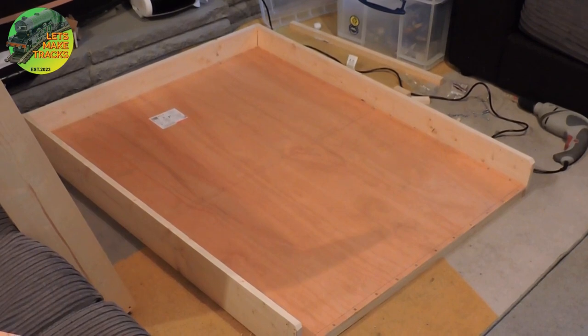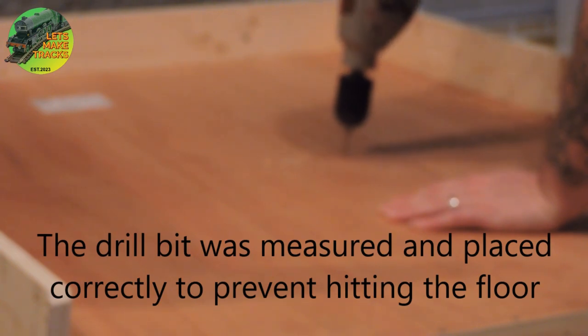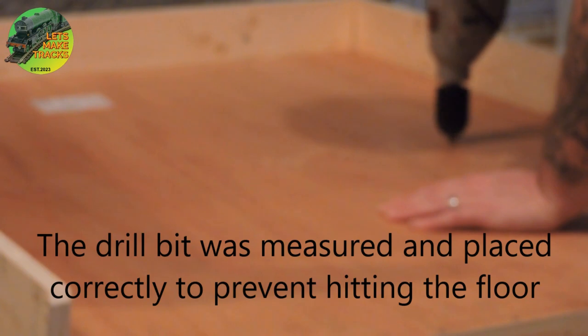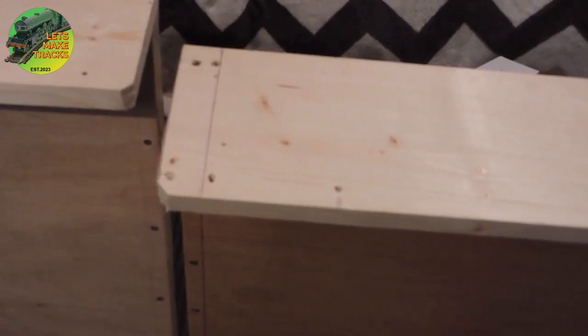Now that the frames are all assembled I can attach the main board on top. I've made sure things are at a 90-degree angle and I'm going to drill throughout to make sure it still fits. I mark out where the beams are under the board, then drill through my markings every ten centimetres through to the batten below — so I'm screwing through the board and the batten at the same time. Then I pump the screws straight through, but before that I flip it over and apply a PVA glue, which I didn't actually film.